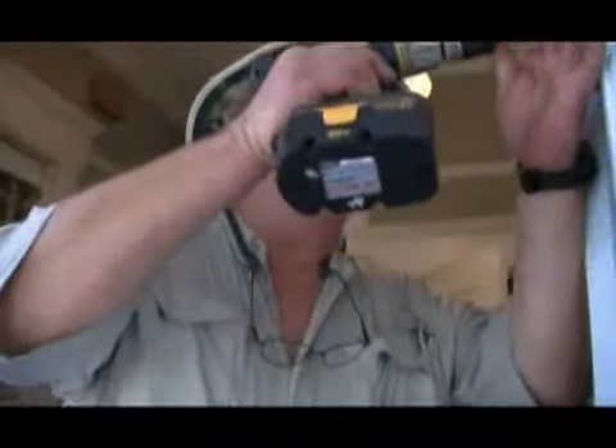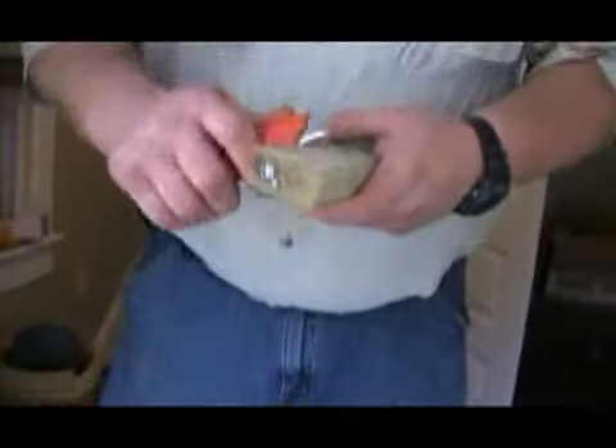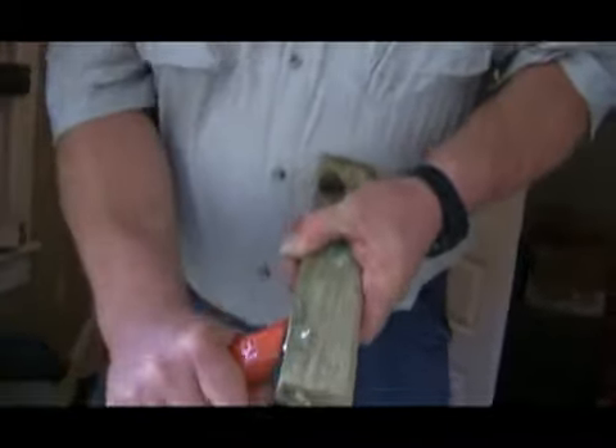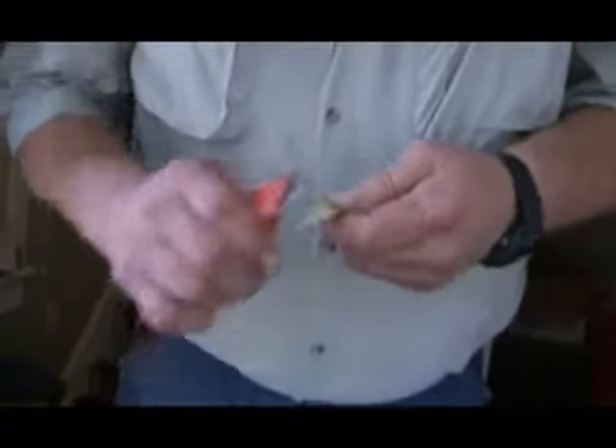What you do is you remove your screws and you take a piece of old wood, any sort, and you cut a little sliver off of it — a wedge of sort. You can make a wedge: you take this and you whittle it down to a little point, try to make it round. It really doesn't matter too much if it's perfect or not, you don't have to be, and you can even leave it long.